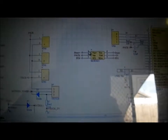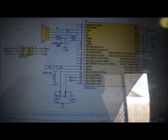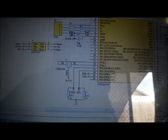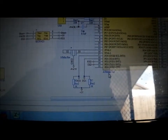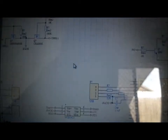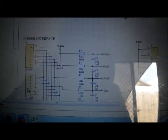The ADC will provide readings to the microcontroller, which is an ATmega32U4 — it has its own USB, which I'm not intending to use much, but it's nice to have for reprogramming. The I2C clock and data lines go to both the ADC and the battery monitoring chip through a header so you can disconnect that easily. Over here is the main power front end.